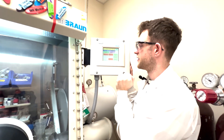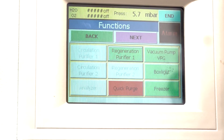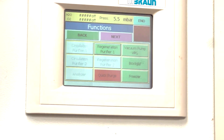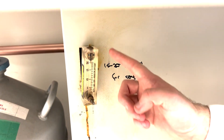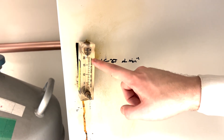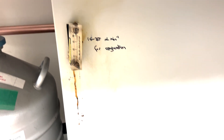We're now in this mode and have the option to regenerate. We click 'Regeneration Purify' and it raises an alarm. If you look down at the flow meter you should see that the little black ball has risen up — that tells us there's plenty of regeneration gas flowing through. It should be about 15 to 20 milliliters per minute, and it's just a little bit over 20, so that's fine. Regeneration gas is flowing, which is very important because we don't want the box to suddenly run out of gas in the middle of the night.